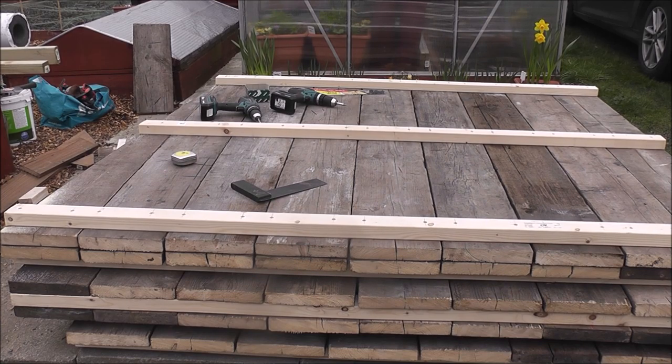Okay, we've got a few gaps, but that's designed that way because the wood's bone dry. When the wood swells up a bit, all them gaps are closed. That's the way it works. But we put sealer in there as well. We could have just used tongue and groove, but I haven't got the machines to do the job here, so I've had to come up with this idea. It's worked perfectly well for the other shed. It's just doing the best with what you've got, basically, and that's what I've done here. Like I said, they're the lats, that's what hold the sides together.